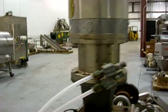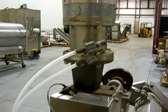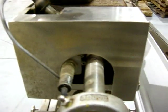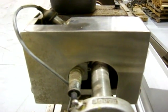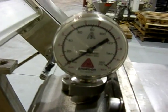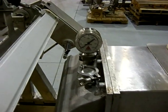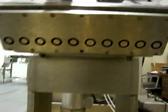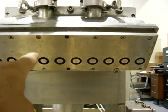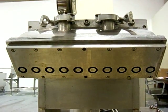This is a pneumatic clutch brake and Baldor motor, and this is what stops the unit at the top of its stroke. There's a prox switch here that reads a flag on the shaft in order to tell the unit to stop at top dead center. We also have a pressure gauge here — I'd recommend keeping the pressure less than 120 PSI. Your products are probably going to run best between 30 and 85, but if you get up over 120 you could see damage to the die. The bolts on the front of the die — these 10-32 and quarter-20 bolts — could pop off. It wouldn't be an explosion, but the die would be stressed and you'd need a new die.